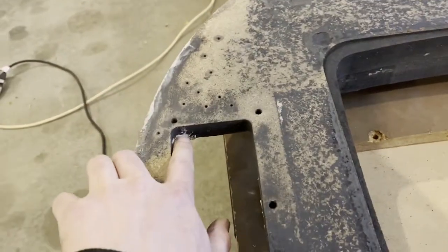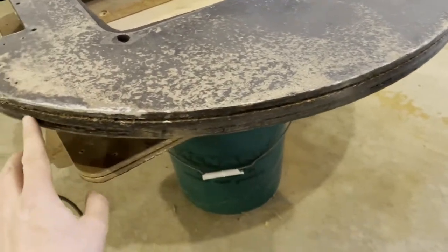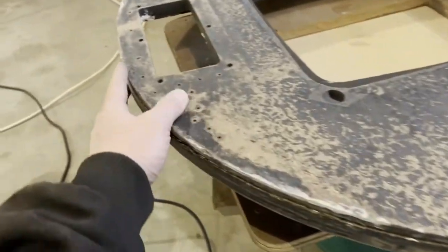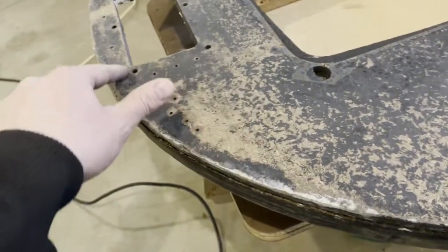You can see some here I haven't sanded off yet. I took this whole top over to him, he laid it on edge, and you wouldn't believe the amount of liquid epoxy — it's like a water-thin epoxy — that he was soaking in. He got around the edge here that was all flaking, and he ended up drilling eighth-inch holes and injecting with a syringe all around here.